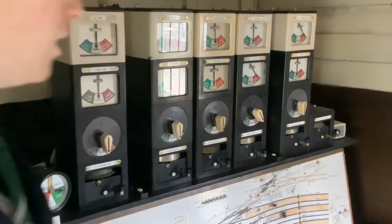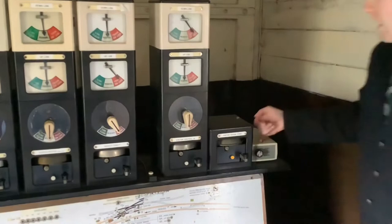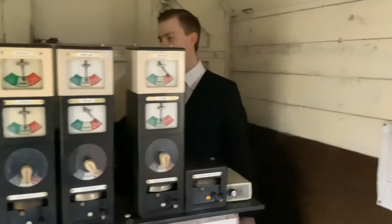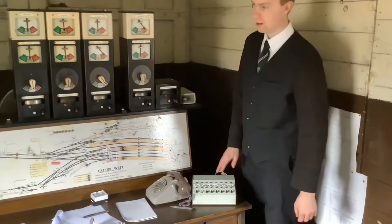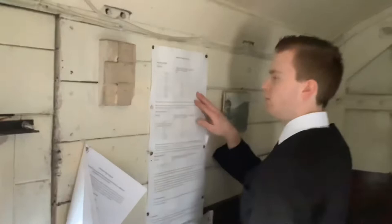You've got the relief line and platform line middle, and you've got the extra central block bell unit and instruments. The little bell on the end is for the goods yard — they are switched down at the moment. This unit is for the telltale lights: if you put it on seven seconds it goes seven seconds and then goes out automatically; if you do it manually you have to cancel it manually. None of these are locked with the locking rod — we're basically just winding straight into the back of these. We just lift the handset, select which circuit we want to phone on and press the button to work the bell. Here we've got the section times for trains from the various boxes, and a diagram of middle to remind us where the clearing point is — the clearing point for middle is actually in the section, beyond Signal 85.